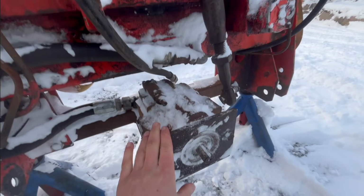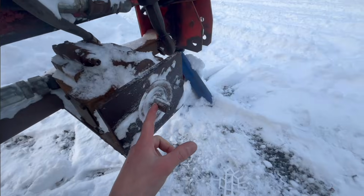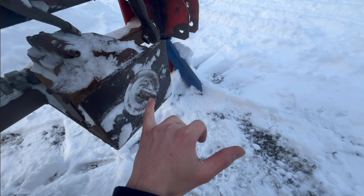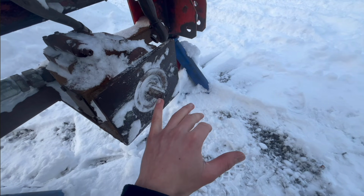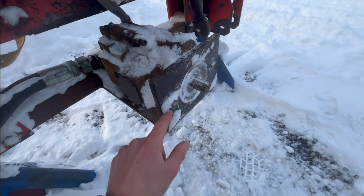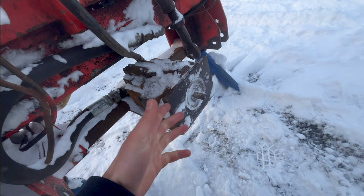And then this hydraulic pump, there shouldn't be anything wrong with that. But between this shaft and the PTO shaft on the tractor is like 20 centimeters, and you can't have a PTO shaft that is 20 or 25 centimeters or whatever it was. So we're gonna have to move this hydraulic pump back this much, so it will end up with a reasonable distance between them. And I think that's the first thing I'm gonna tackle, the first project I'm gonna start on this thing.